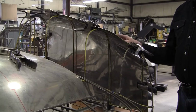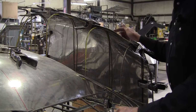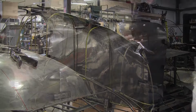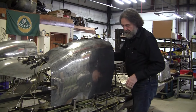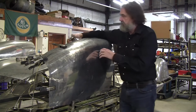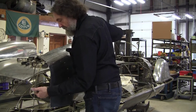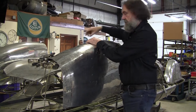All right, so now this is the spot. That's where it's making that turn. That's where it's going to require the most amount of work right now. We got to blow that out. If this comes out, it allows that to go in. I think this will be the last refinement that we'll do on this video. And then the final refinement with the less crowned top wheel or bottom wheel, that's when we'll get this to as close to perfection as possible. That'll be video 3 in this fixing the overdevelopment of the Studebaker panel.